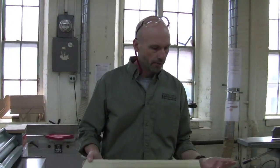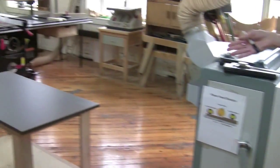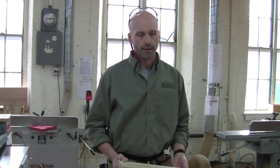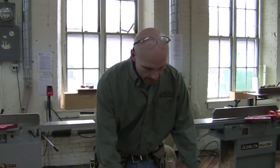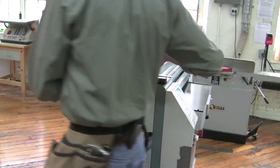Another thing I like to do — when dealing with a large pile of boards — is make sure I've got a system that treats everything consistently and I don't mix up where I've left the board and its grain direction. What I do is get two carts: one at the infeed and one at the outfeed. I might have 10 to 20 boards stacked up, and as I put them through the planer I bring them up in the exact same orientation and place them on the outfeed.